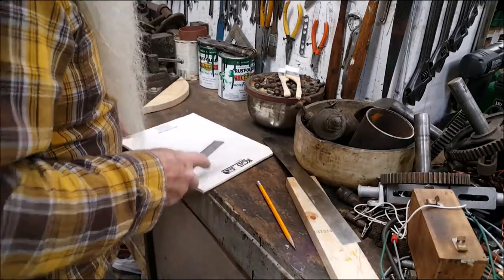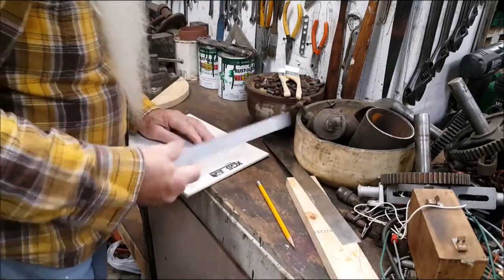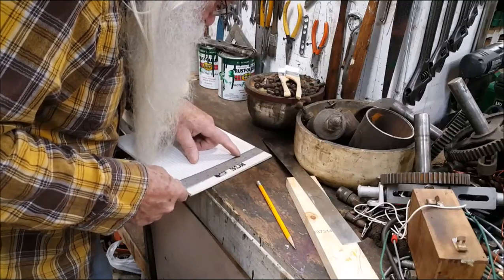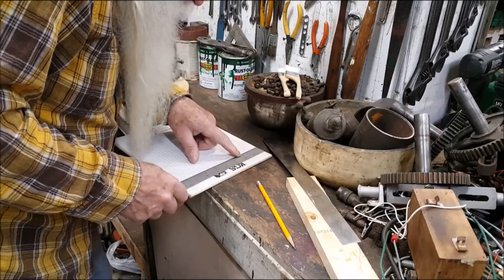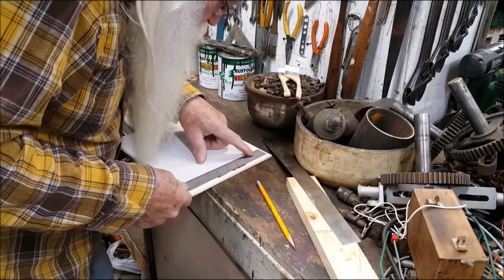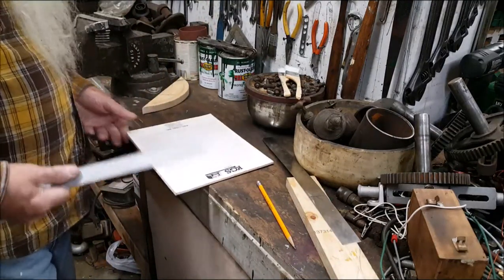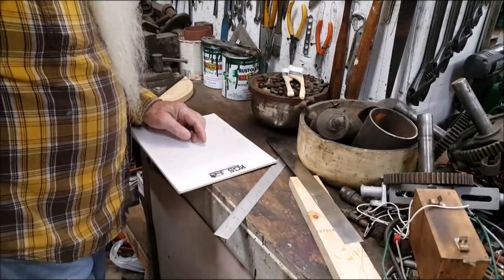Okay, we're working with 64ths down here. Now, I'm just going to call it to the nearest number, because there's some of them that I could do this right here and you couldn't see them either, in slow motion. Okay, that's more than an eighth. I can verify that. What's 2/10? Okay, that's a little more. That's not a good measurement. I'd have to go by the 32nds. So it's 5/32 is the number. If you come down here, it's on the 2. So it's about 3/32 off, which in woodwork, I think I'm going to go with that as being all right.